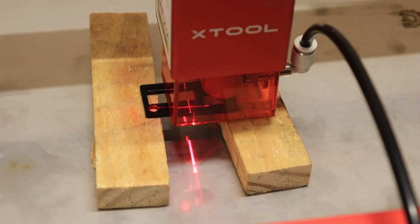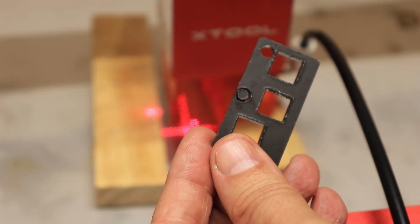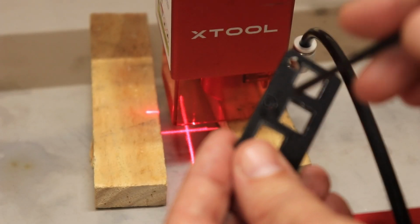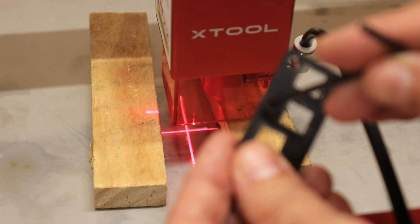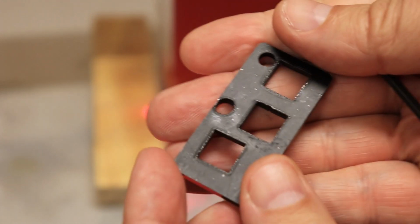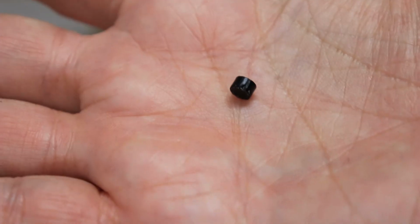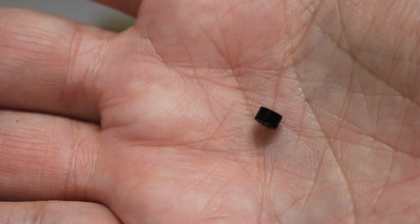3mm black acrylic, and I will cut it with a 2mm per second full power. Here I have some fumes, so cut acrylic only in a well ventilated room. And I can see it's cut and only didn't fall out because some melting part is holding it. But there it is. A very nice sharp cutting in only 1 pass. And this is that cutting part.